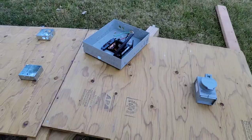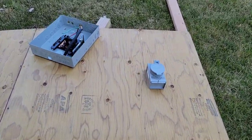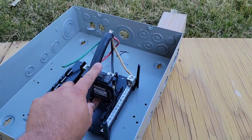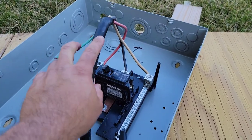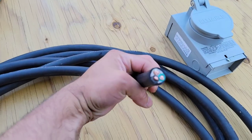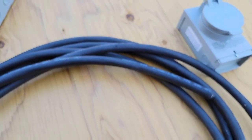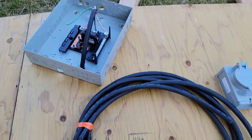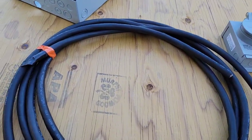Let me tell you some of the upgrades we're doing to the electrical. This right here was our previous mock-up — I knocked it down to the floor because we're not going to use it anymore since we have the trailer now. This is an 8-gauge service entrance cable, which handles about 40, maybe up to 50 amps if you really push it. But what I did now is I bought this 6-3 cable — this can handle about 50 to 60 amps. It's a 6-gauge service entrance cable and I'll link it in the description.